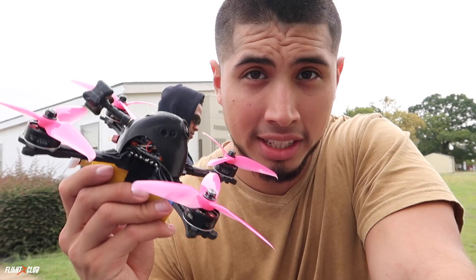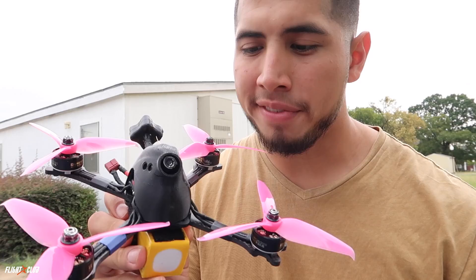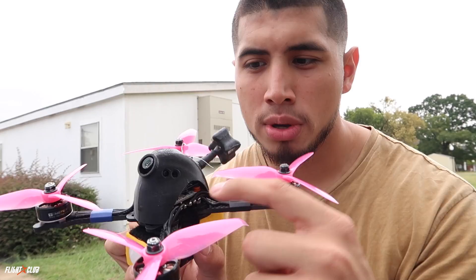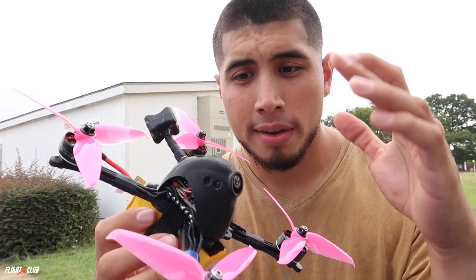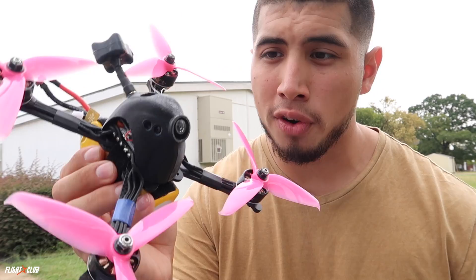Now that you guys know a little bit about the packs, let's go over the setup we're going to be running to test them. This here is the F60 2500KV by T-Motor. We're running our favorite props, the 5152 from Gemfan. We have a 30-amp Cicada 4-in-1 ESC, a Luxe V2, UniFi Pro HV, TBS Triumph, and a micro camera from Foxeer. This frame is a new prototype that FPV Fly Club is working on and should be out in a couple of months. I'm loving this frame so far — it looks great, I love canopies. Let's go ahead and test these packs out and see what they got.